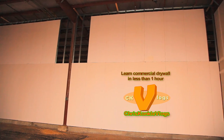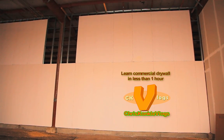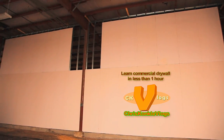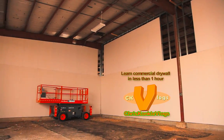Okay, so what I'm showing you here, like I was demonstrating on the bottom, you always start your tops inside the wall, just like you do in the bottom, so you can cut the ends in, because that's not always going to be level, and they can be two different measurements, so to save yourself from huge gaps, you're going to do the ends last.